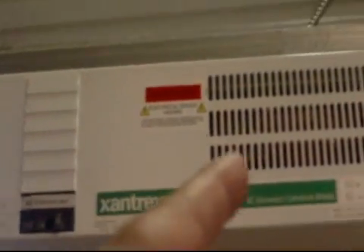So you can see how many days I've been off the grid, with the exception of the air conditioner. Once I change this inverter, I'll be good to go. This inverter is a two kilowatt pure sine wave inverter. I've had it for about a year and a half and it's been really good. It takes 12 volts, goes through my T240 transformer, and takes the single phase 120 volt output, pushing it up to 240 volts.